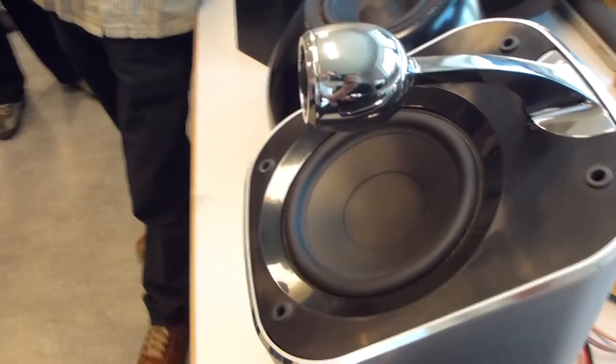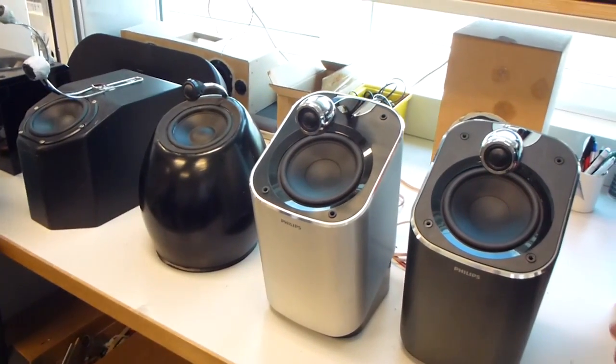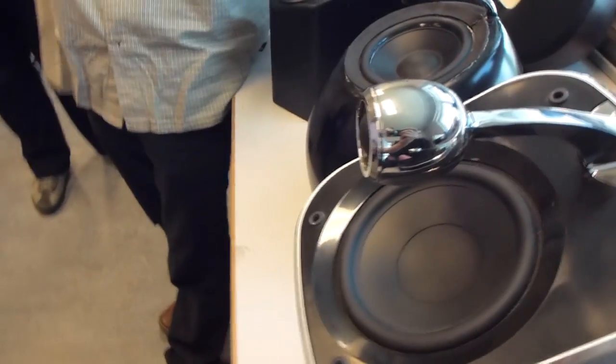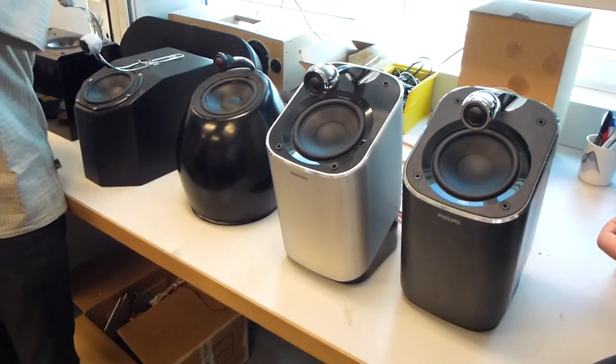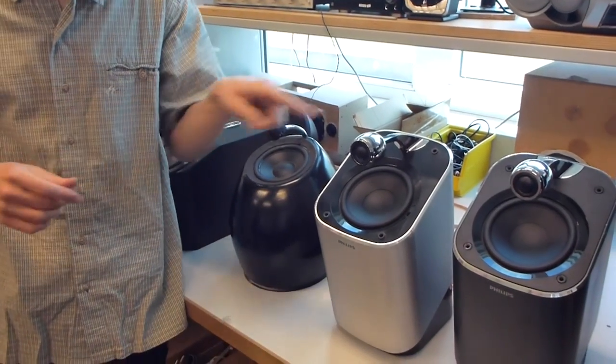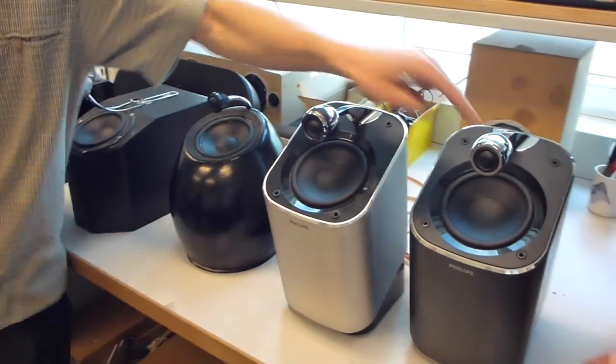This recessed tweeter creates a kind of tunnel in front of it, which has a few effects. The obvious one is that the sound cannot really go out to the sides compared to a non-recessed tweeter. Also, this tunnel creates a mass of air that moves — imagine a spring and a mass: if you shake the spring, the mass will not follow as quickly. It's the same for the mass of air. If you want to move it, especially at high frequencies, it will not move fast enough, actually slowing down or reducing efficiency at those frequencies. You will see a small increase at resonance and then a decrease at high frequencies — all because of this 2mm of air.